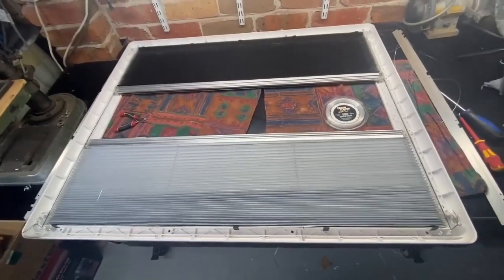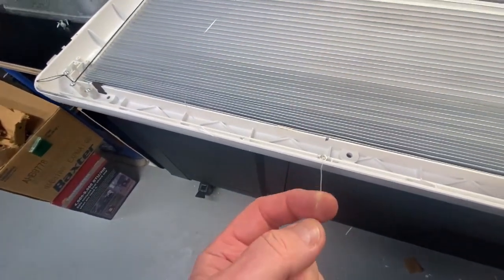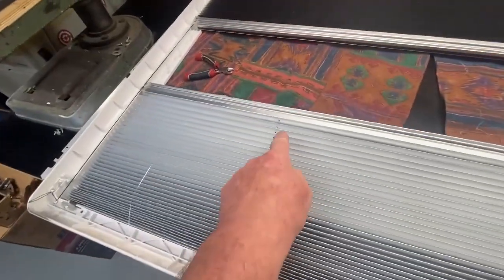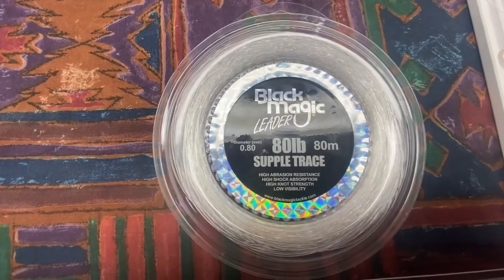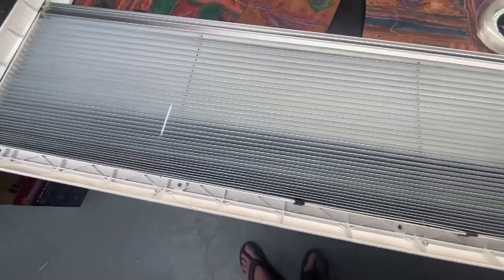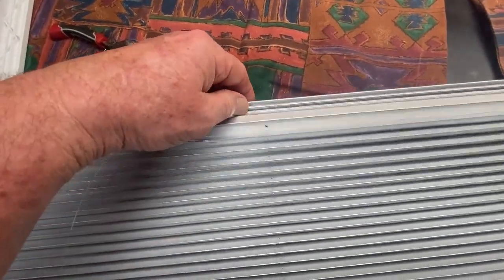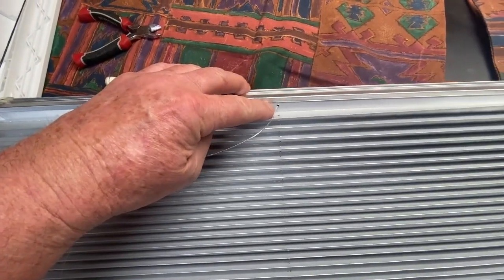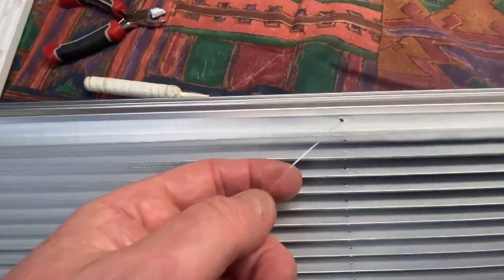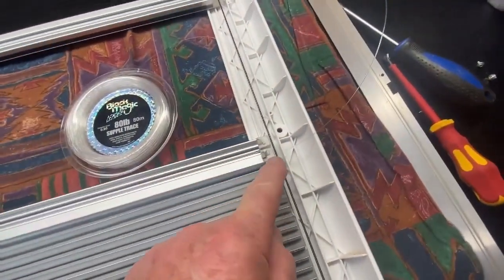Now we've got the screen on the bench. What you need to do is to restrand the cable — the wire — which is really a fishing line, back through the screen. What we've done is purchased from BCF 80 pound trace line, which is a little bit stronger than what's there now, but you can't have it much stronger because otherwise it won't flex. What we've done is fed this line — on this edge here, if you just lift it over a little bit off the edge because we've taken the trims off the sides — you can see a little hole in there. We've fed this line into the hole and gone in this direction to go over here through this little clip and up.